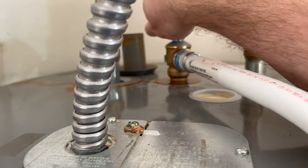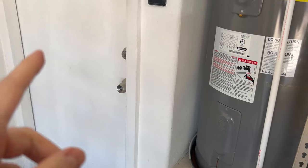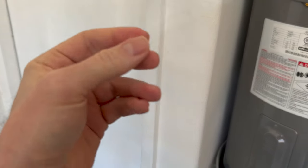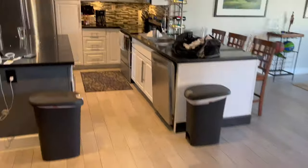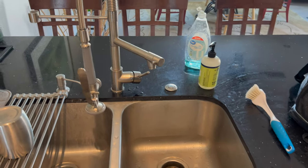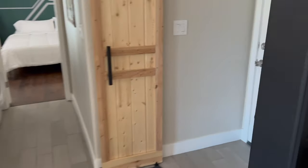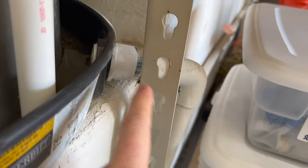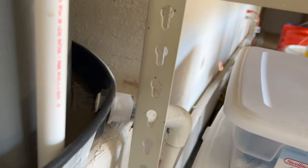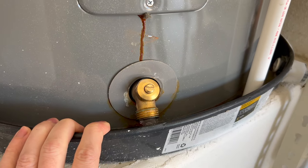Up here on the T&P valve, you can also help release some water this way. I've opened that up. It's also recommended to go inside the house and open up a faucet on the hot water side to create some airflow, so we're going to do that right now. There's nothing coming out right now — that could be because we have a pressure issue with the tank — but we're going to go back outside and keep working on draining the tank. There's some water coming out now and I have a PVC setup that takes it from the pan all the way through the garage outdoors, so we don't have to worry about flooding. I have it going at a moderate pace, so we're going to wait for that to drain and then continue with the disconnection.